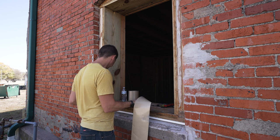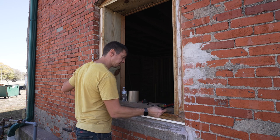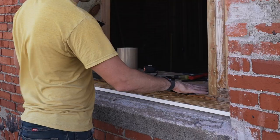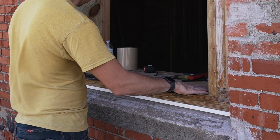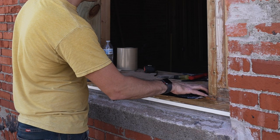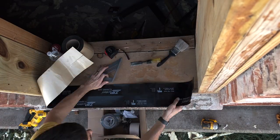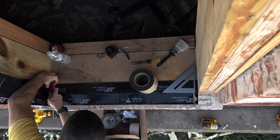I realized that the Huber Wood Company sent me both the stretch tape and some of their normal non-stretch 6-inch tape. Instead of using the stretch tape for the whole window, I decided to use the normal non-stretch tape to cover the bulk of the window framing and to then go back over the corners with the stretch tape.